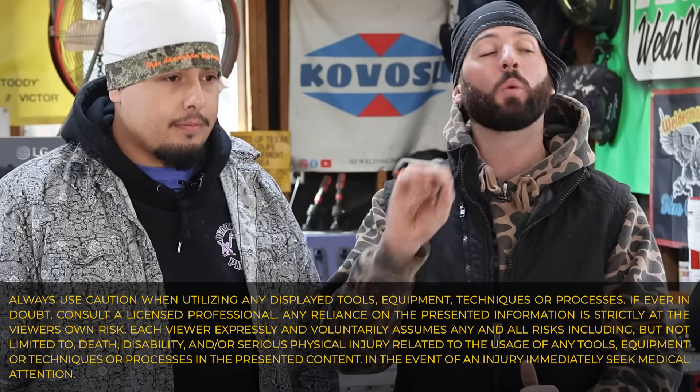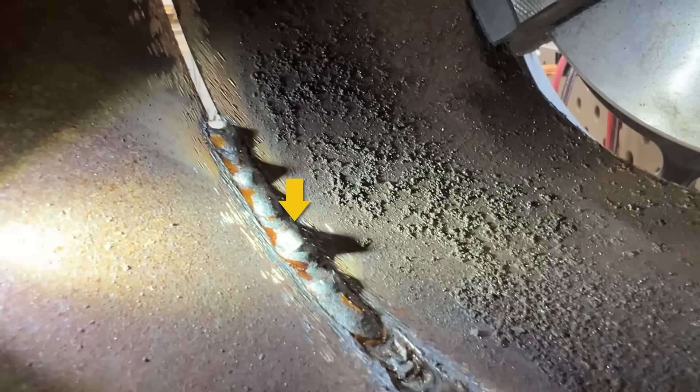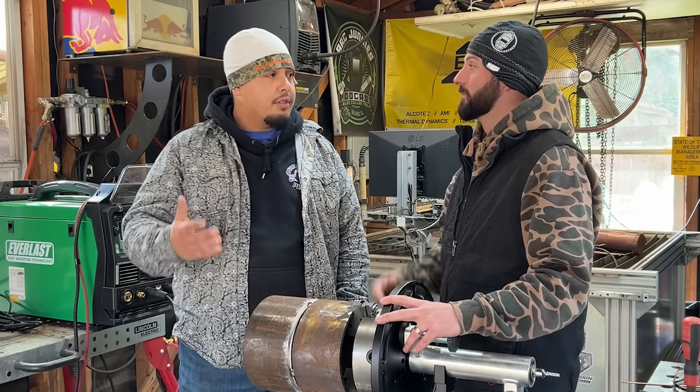Like you and many others, there's a lot of different defects that you can get on the inside of a piece of pipe when it comes to open root TIG welding. Today we're going to go over pretty much everything. Right there at the bottom, gravity in a 5G weld specifically — sometimes you get sucked back on that bottom. The gravity is bringing your weld down. If you're not putting your wire in the right spot and feeding enough, you have a concave root or underfilled root — suck back. Then as you're coming up the pipe, typically people start feeding a little bit hard or heavy and you get some cold wire. That cold wire is no good. It ends up being a sharp piece on your TIG root or it's excessive reinforcement. Usually they want about an eighth inch reinforcement max, and in some places in production they almost wanted it flush — so flush to an eighth, you have a lot of tolerance. Depending on the procedure, you got to make sure you ask them because sometimes it's too much.